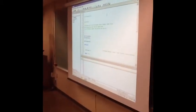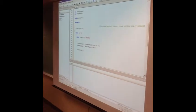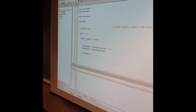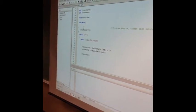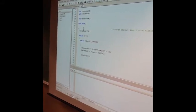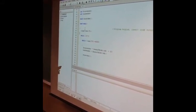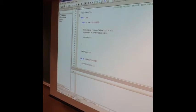All right. As far as code goes, what I started out with, I had a clear timer because I ran the night and day off a timer. I ran it for 8 hours and it was going to be off for 16 hours. For the example up here, I did 8 seconds for the day and 3 seconds for night, just so it'd be easy to test. So I have a clear timer at the very beginning, so it clears out that timer, so it starts at 0. Then I put a while 1-to-1, because I have a cycle that I run continuously. The first timer I have for my day, so then I have while time 1 would be 8 seconds. So this first group is for the day, what it would do when it runs during the day.